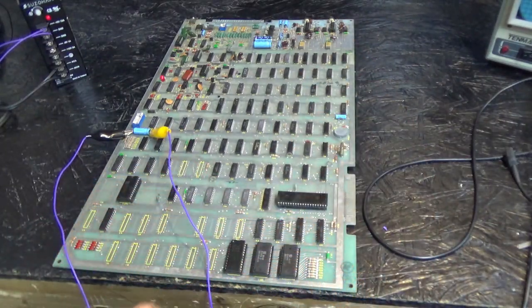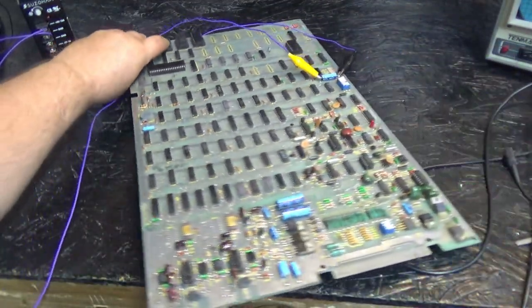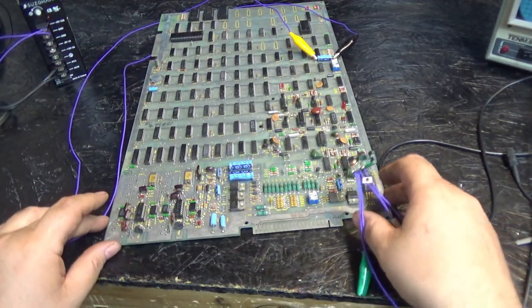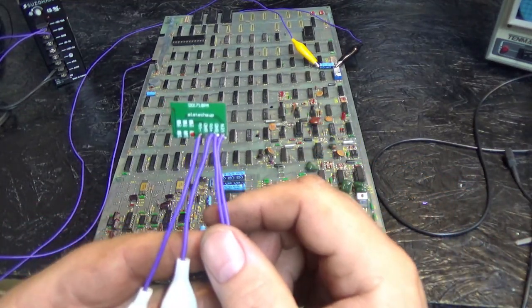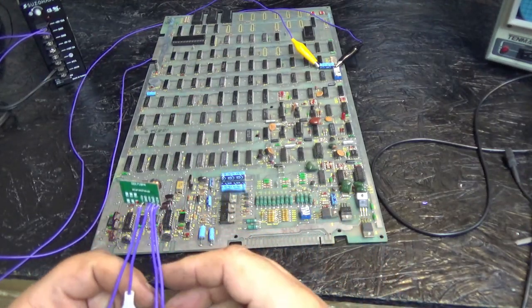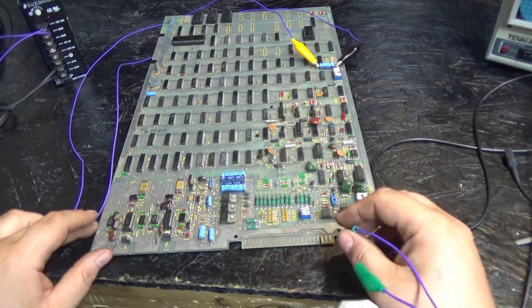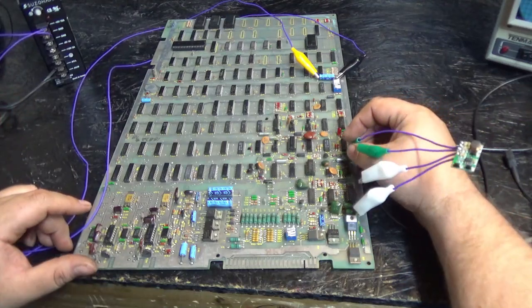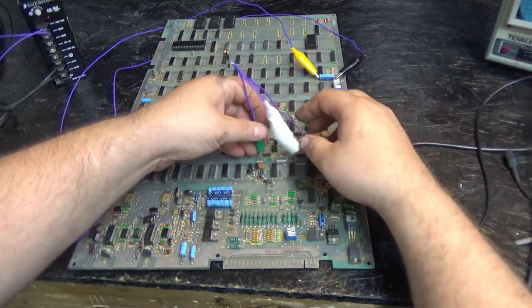It's no big deal. What I'm going to do is take off the power. Okay, my power is switched off. And let's move this over to the vector side. You can buy these on eBay, by the way. They're really cheap. They're just simple plus and minus DC to DC converters. Voltage in is labeled right on the back of the PCB, right? Let's find a 5 volt tab. It's right around here. There it is. 5 volt, and there's a ground. Let's connect to our ground.